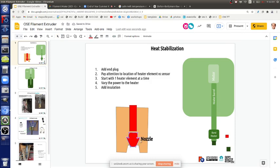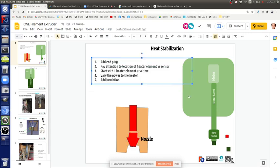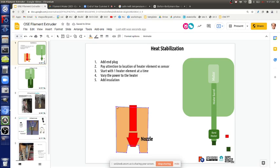We've got this pipe insulation we've been using, or you can use fiberglass. Do you have any aerogel? Sorry, not this time. So that'll be for the insulation part. If we're keeping the temperature in, we should get to the point where we set it at, say, 230, and you literally get an ooze out without even running the motor. Have we seen that a little bit? I've definitely seen it, but not at that temperature. It's been way above. I would say it flows quite nicely when it has that little interval of good temperature.